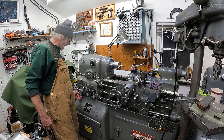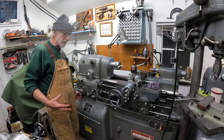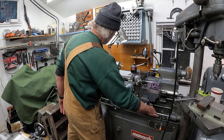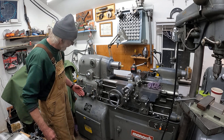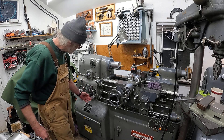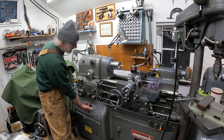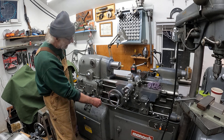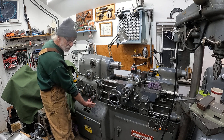I start the lathe at 600 RPM — it's just easier on the machine, less of a jolt. I've got that little mark on the knob. That's turning slower now. The one knob you can use on this machine while it's running is the CDE knob right here, which gives you three feed speeds — fast feed, medium, fine. You just don't want the carriage engaged. It's okay to shift that knob while running — nothing's grinding.